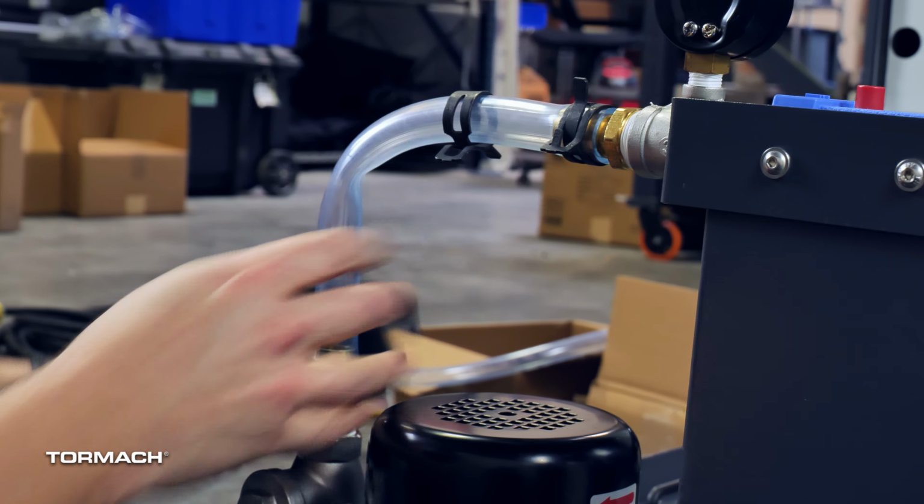Resecure the hose and clamp it down. Screw the 2 coolant manifold standoffs onto the rear of the machine casting, just above the pass-through cover. Tighten with a 13mm wrench until snug. Attach the coolant manifold with the aluminum fitting pointing to the left and secure with 2 M6x10 flanged button head screws using a 4mm hex wrench.